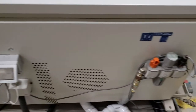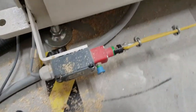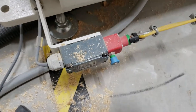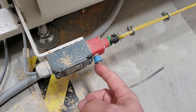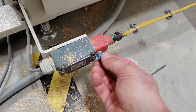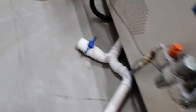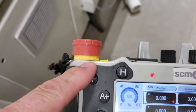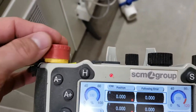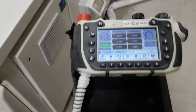While this is starting up, we're going to do a quick walk around. We're going to check that the safety devices have not been triggered. As you can see, this one's got a green. If it was tripped due to sweeping or something like that, it would be recessed — all you have to do to re-trigger it is just pull it out. We'll check this side and the other side, and also check the stop here — make sure that is up. This is a press-down stop, and then you have to twist it clockwise to reset it.